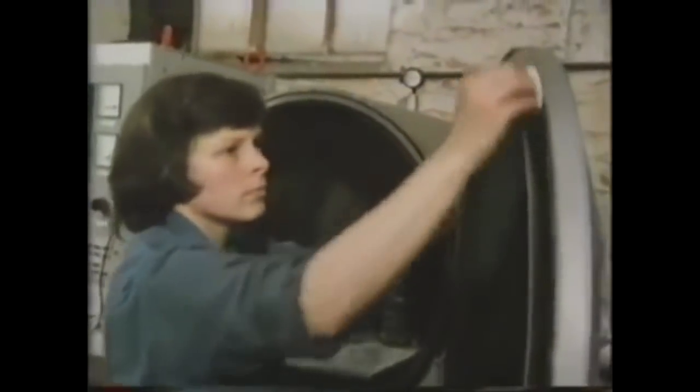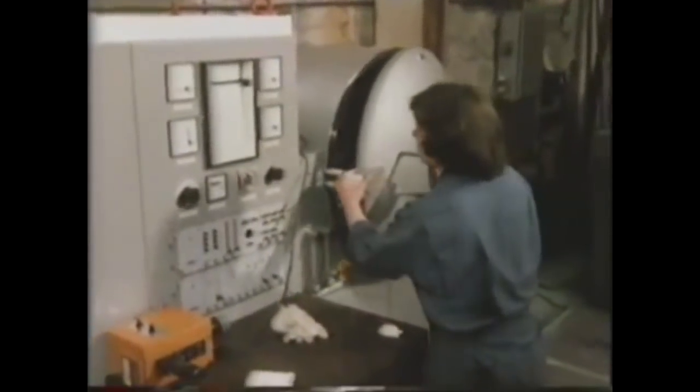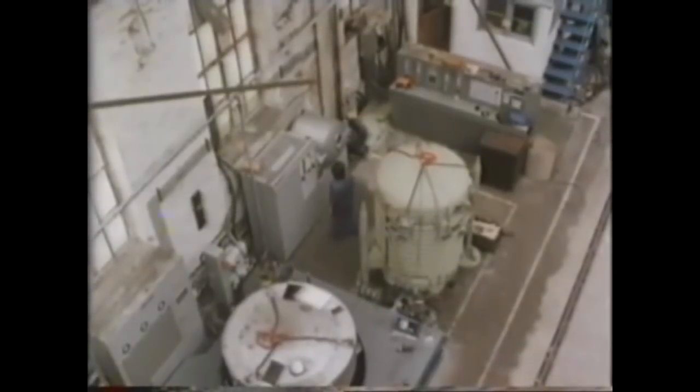Then the seals on the chamber and its door are cleaned and greased to ensure a good vacuum. The process can be carried out using either pure nitrogen or mixtures of nitrogen with hydrogen or suitable hydrocarbons. Treatment times vary between 10 minutes and 20 hours, depending on the grade of steel and the depth of nitriding. The components are connected as the cathode and the furnace walls as the anode. Under this potential difference, the molecules and atoms of the treatment gas, in this case ammonia, are excited and ionized, producing a luminous phenomenon known as the glow discharge.